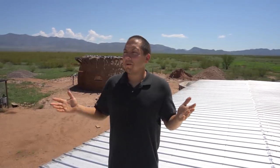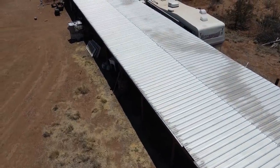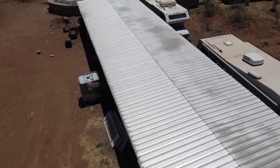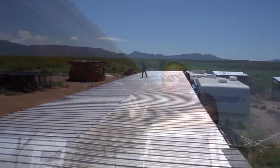Let's talk collection surfaces. I built this roof as a way to give us some shade but also to collect water. This thing is 2,200 square feet and I opted to build it with metal roofing. Metal makes a great surface to collect water off of. What I do not recommend for collecting rainwater is any kind of chemically laden surface — I wouldn't collect water off of asphalt shingles or anything where you could pick up a lot of chemical residue.